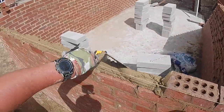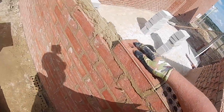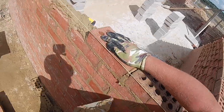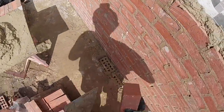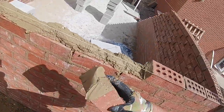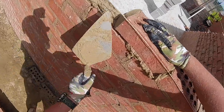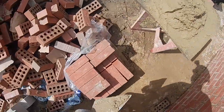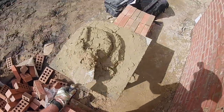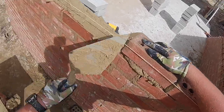There are different ways to lay traditional that can be faster. I'm not a big fan of putting your joint on the back side of the brick and then laying it. I find that quite awkward to work, with torque on your elbows, it sends your elbows and wrists into a weird position. So I'm a big fan of either doing the front and back tip, or the front tip while the brick's on the wall, or putting the joint on the front of the brick, as you'll see me do right here, which I was laying the majority of the time like this